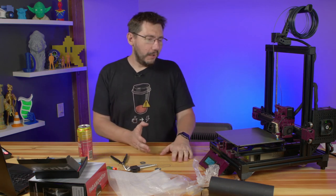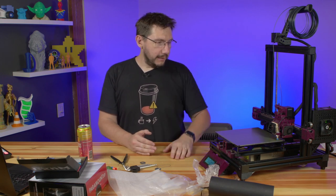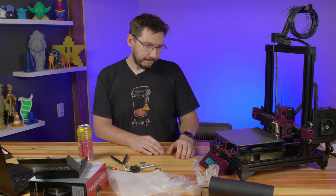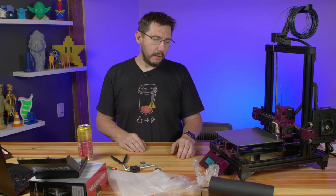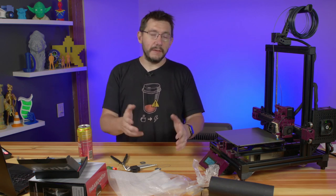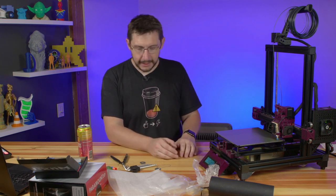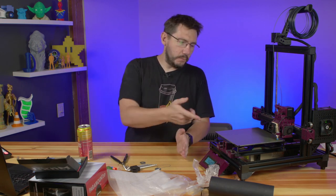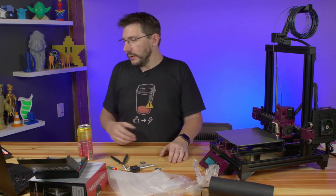So here's the goal then. I've cleaned it off. We've got to get Loyal his bolt and his nut. This should be the successful one. It would be neat though if it had that sort of leveling test that the Prusa machines have. I think that's kind of handy. Or maybe the Chuck leveling test. I know Chuck Hellebuck loves to talk about his leveling test, rightly so, because it's incredible. It does only heat the bed to 50C. 50C with the bed should hold PLA. I mean, 60C is better, but you know.